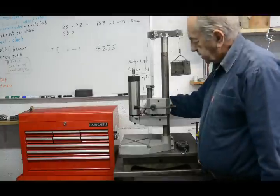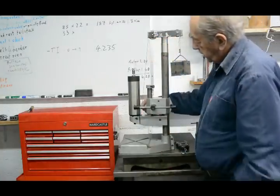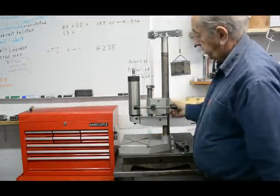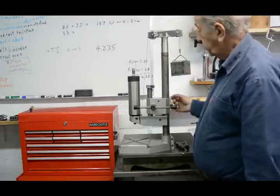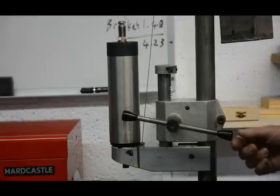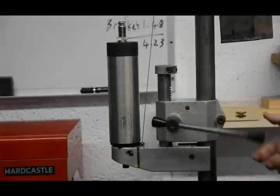Well, what we've got in this test is the cable's fixed at the balance point, but the pulley's still in the original position, so the cable slopes back a little bit, so the moments aren't exactly balanced, but we'll see with a close-up view that they're pretty close. You can see that it's very easy to move just with a little finger, hardly any noticeable force, and we can see that it just moves under the weight of the handle.